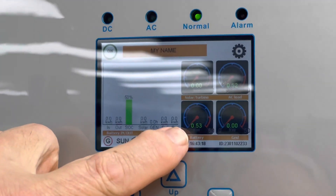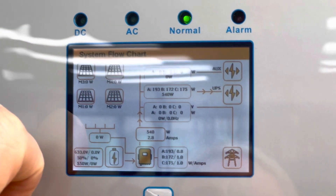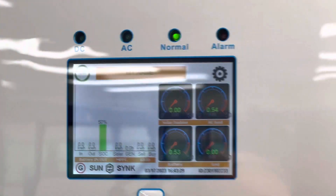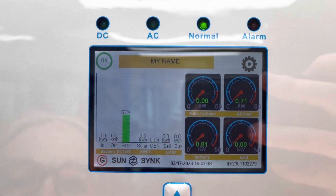You can see the battery is discharging right here. If I go into my flow, you can see the power — I'm running a load here of some incandescent lamps, and the load is pretty well balanced: 0.53 off that unit. If I look at this one here, it's running slightly higher. It's probably because the battery levels are slightly different, but it's pretty well balanced.